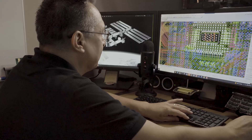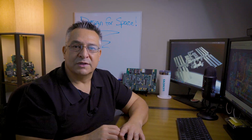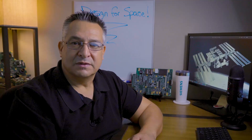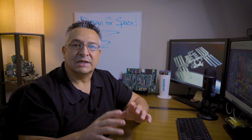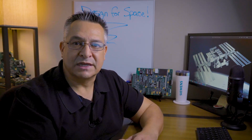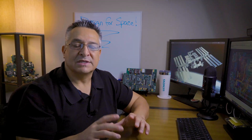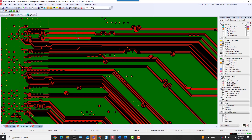Making any kind of change in the design can't be done without proper documentation and approvals — there's no room for the 'that's okay' mentality. Trace spacing and widths are not just determined by PCB fabrication yields. IPC Class 3 is the class you should be using when designing for space. A good IPC spec to start with is IPC 6012 Space and Military addendum, which provides IPC Class 3 exceptions for environmental conditions that PCBs are subject to in space applications.